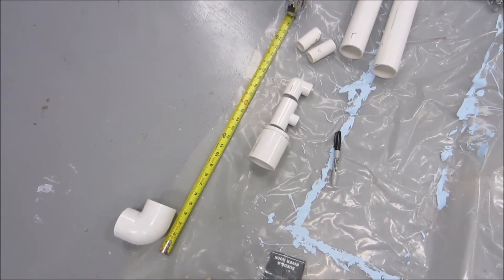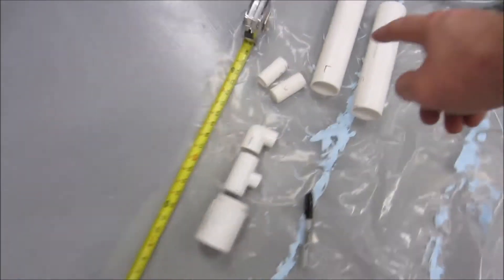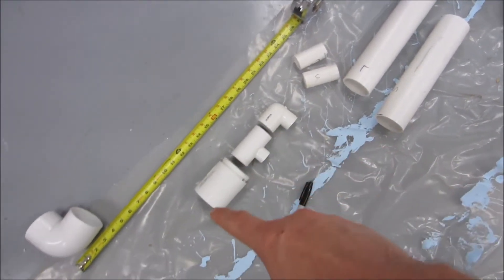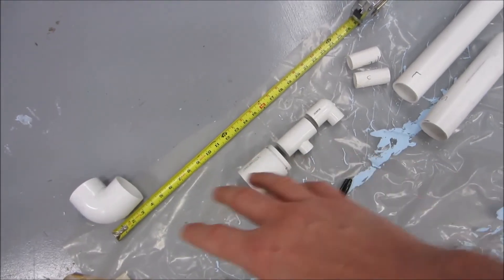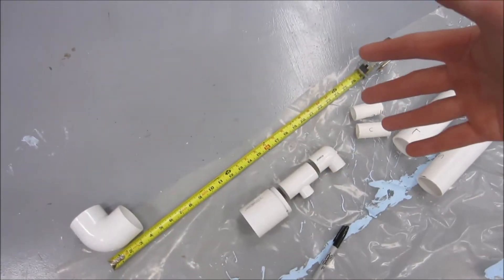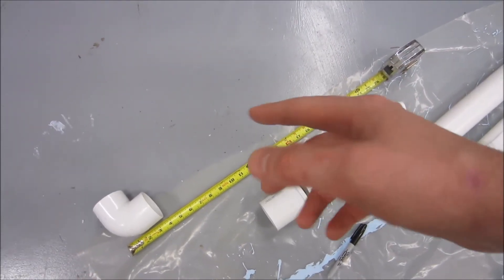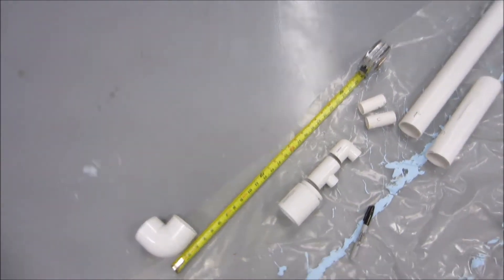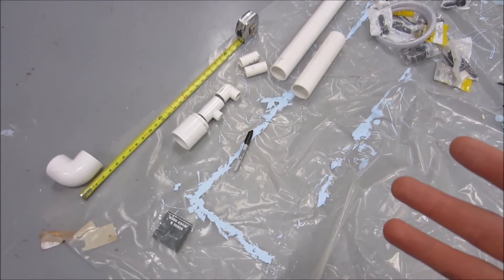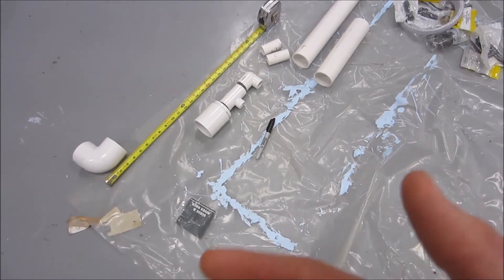What I'm making here is an air bladder of sorts, which does the same thing as a pressure tank for a well. I'll have these 2-inch pipes and these 1-inch pipes coming together, and they'll make an L-shaped tank. Water will push against it, and then the air will push it back out, checked by the action of 3 hydraulic solenoids. The concept is to build up enough pressure to clean out a watering bowl automatically — spray out all the sediment — but it's going to take a certain action to build up the pressure and then release it suddenly.